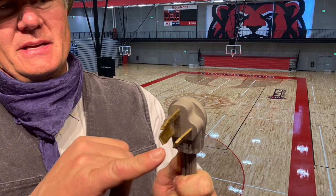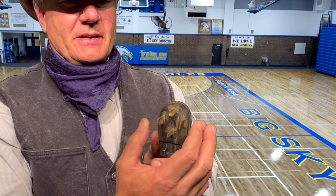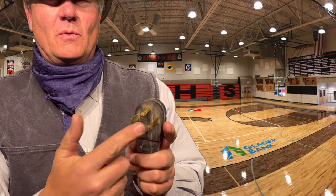Coming back to final thoughts — I want to talk about these power cables. This cable: this is your ground, and these two are your hots. On the four-pronger, the two in the center are hot, and the two horizontal ones are the grounds. Throughout the video I was talking about a dryer — this will also work in a kitchen stove receptacle. They're basically the same receptacle. So either a dryer, a kitchen stove, or sometimes an air conditioner, you can plug into to power your big machine.